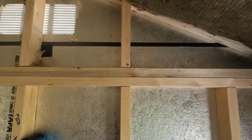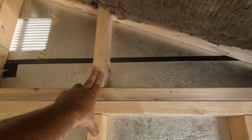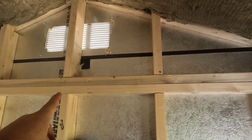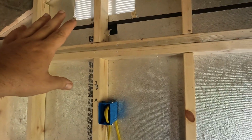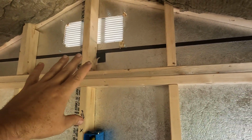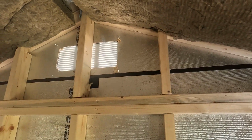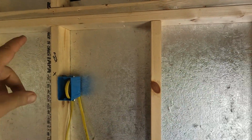Well, kind of the same thing up on the roof. So yes, here on the gable ends, they put these studs here that allow you to, so you don't want to have a cut piece up here. So you're doing your full sheet. You cut your full sheet at the angles of the roof, and then it overlaps the wall, so that the bottom of the sheet is more down here.